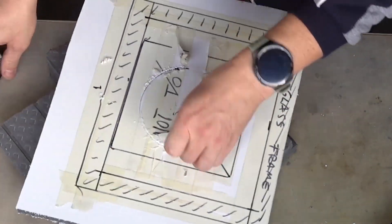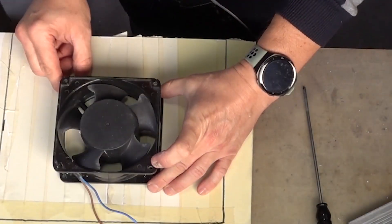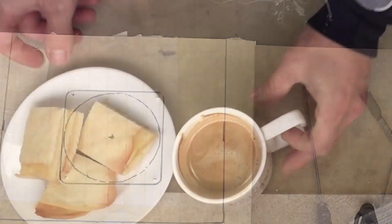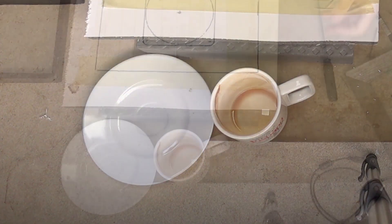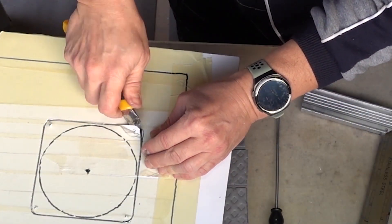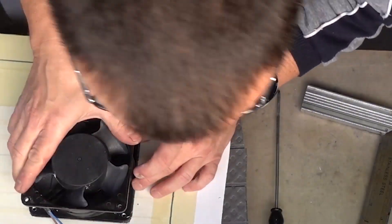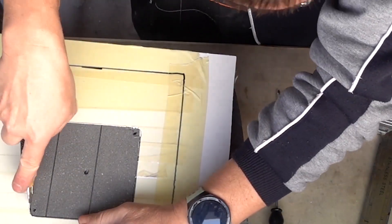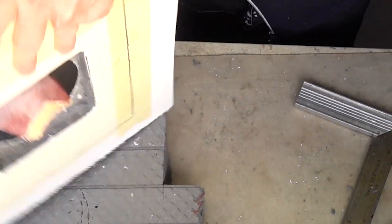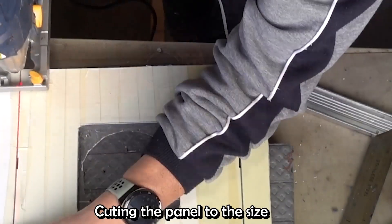I am making a round hole on the outside, where the gravitational flap or grill will be. And a square one on the inside, for this fan to go deeper into the material and to protrude very little on the exterior. This is because I had this square fan from a computer cabinet. For a commercial bathroom extractor, just a round hole is enough.